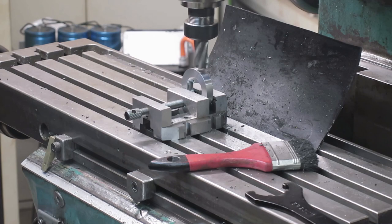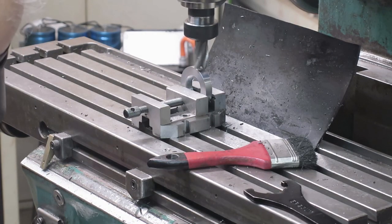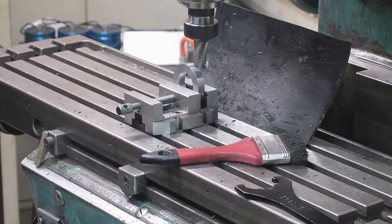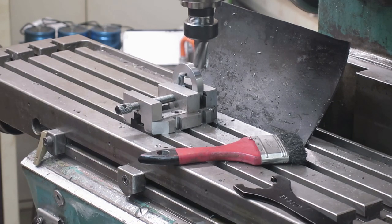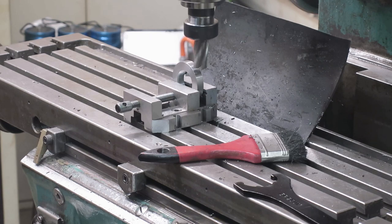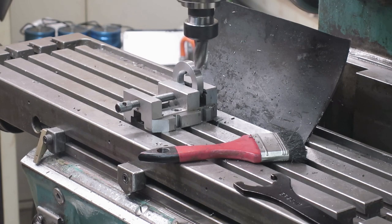So, let's see. I will first touch here. Okay. That was quite a heavy touch. A little bit back, and I believe there we are. Let's see. Zero in the dial. Yeah. Okay. And now it will be 2.5 millimeters. So that's 1.5. And then 2 millimeters more. 1.5. Yeah, 1 millimeter more. There you are. That should be correct. Okay.